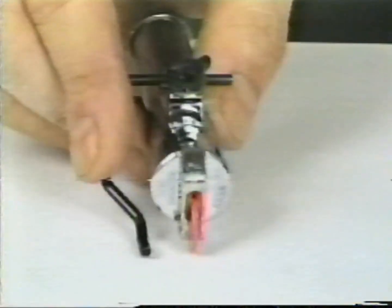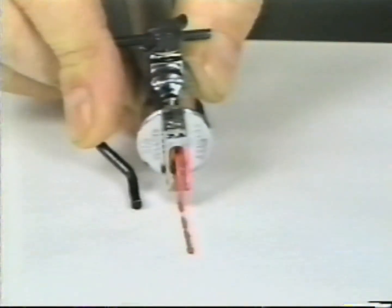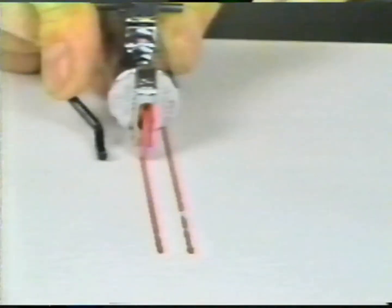When using the guide arm, be sure to put pressure on the paint wheel, not the guide arm, as this can tend to lift the wheel slightly from the surface. Instead, lift the guide with a slight twist, allowing the wheel to make flat contact with the surface to be painted.